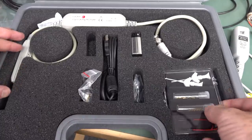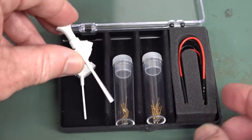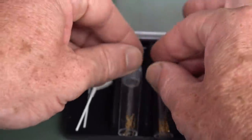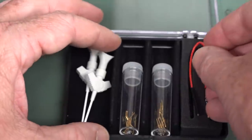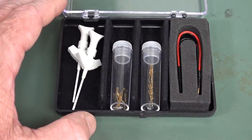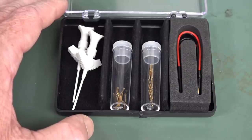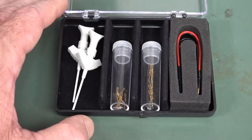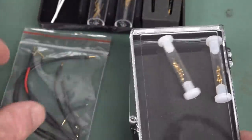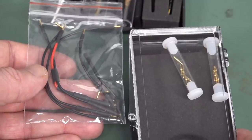These things always come with all sorts of accessories. The CalTest probe comes with beautiful tiny mini grabbers, ground and probe pins, and little pins that plug into headers. On serious designs — maybe a prototype board measuring a high-speed DDR bus — you might have dedicated test points or connectors for these high-speed probes. The Siglent ones come with spare tips, because you'll go through them. You might even want to directly solder the tips into your circuit so you can physically connect and remove your probes.